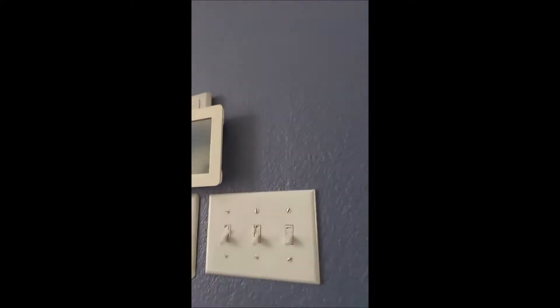That air has to come from somewhere. What winds up happening is the air gets pulled in through things like the gaps around your switches and your electrical outlets. What's behind there you can never clean — it's really nasty, dusty, and dirty. The whole house has a suction because of the negative pressure of this dryer. We've already added a fresh air intake for the entire AC system; this is a secondary one that will give air exactly where it's needed.